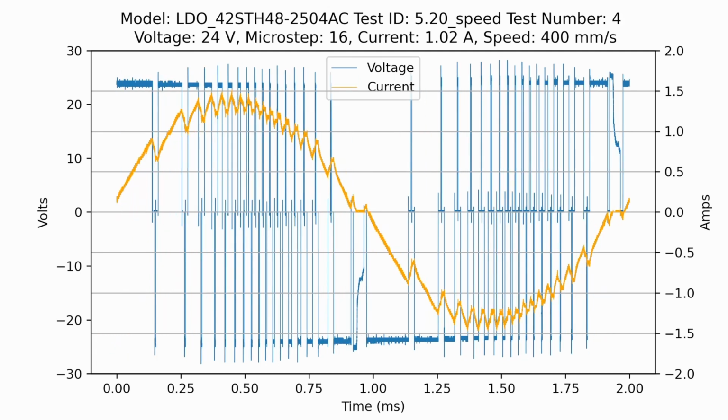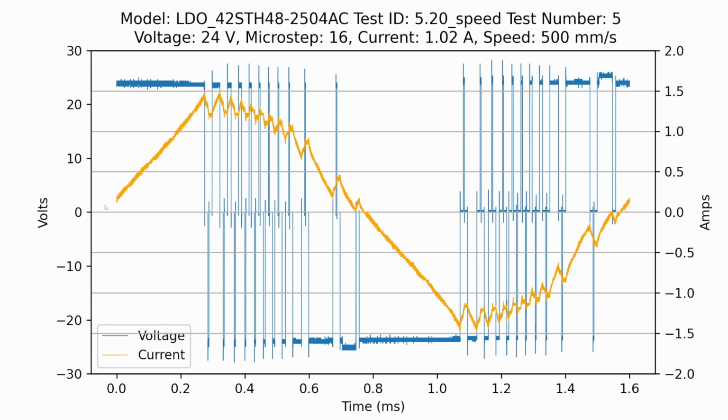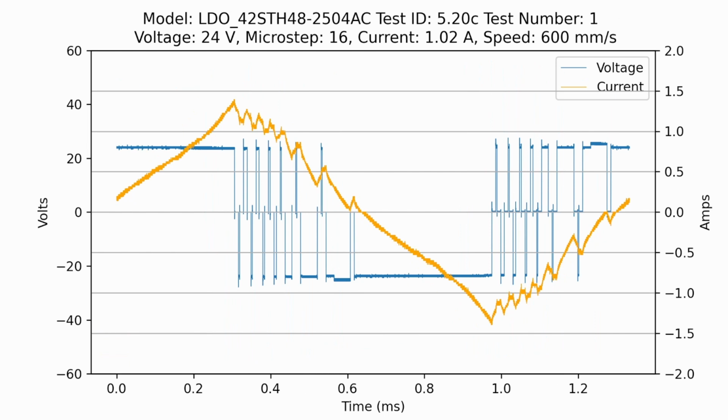And as we keep going higher and higher, we start changing from a sine wave to more of this weird kind of triangle shaped wave. And this means that we're not really getting as smooth of an output in that magnetic field. If we looked at the actual vector of the direction of this, it wouldn't line up perfectly with that circle anymore. It would be distorted.